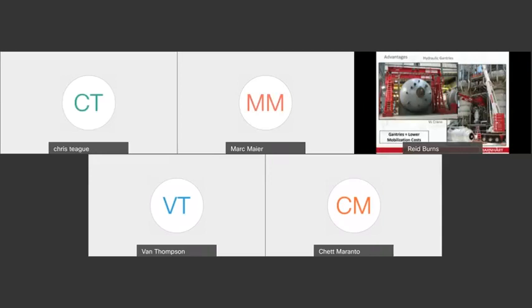Now, gantries, on the contrary, don't rely on balancing loads about a slewing bearing, and so therefore they don't require counterweight. So what this means is that you've got a system that's capable of lifting more than 500,000 pounds, but may require as little as 3 truckloads. And so when you compare that to a similar capacity hydraulic crane or even a crawler, you may be saving a minimum of 10 to 12 truckloads. Not to mention the time it takes to stack out your counterweight and the space you have to hold the trucks that hold the counterweight. So a lot of advantages of being able to take these hydraulic gantries and stick them into tighter spaces.